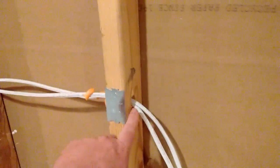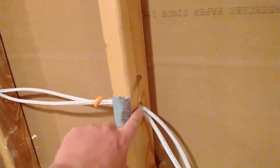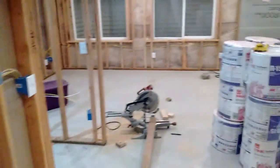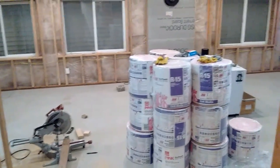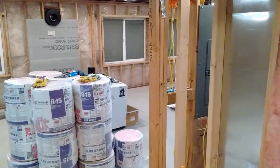Here's another one: if you cut a hole in your stud and it's a little too close to the outside — I think it's like an inch and a half or inch and a quarter or something — then you have to get a nail plate. That just protects from the sheetrock screws. Anyway, this was Brigham at the Farm with a quick little update about my basement electrical. Thanks for watching.